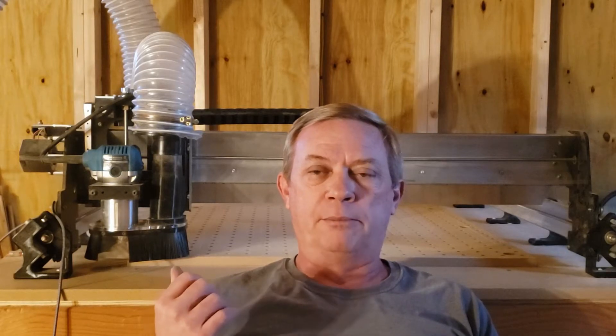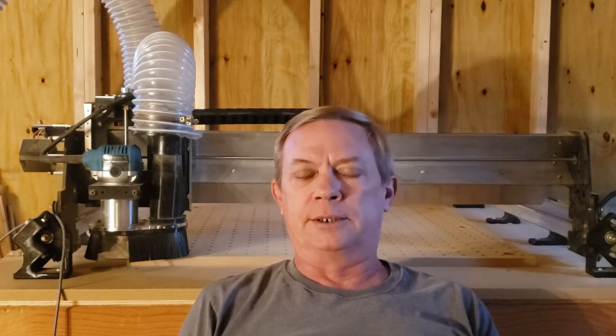How did I solve this problem? I added humidity to the air. I know it's a little out there, but static electricity is worse when humidity is low. When I was having problems, the humidity in here was right around 28%. If you can get it above 40%, you're probably pretty good. That is true for my planer and table saw, but it is not true for anything that runs on electronics — a CNC, a laptop, a tablet. Static will kill your jobs.